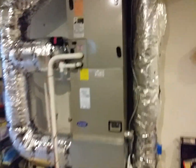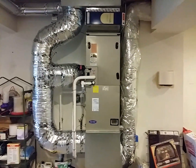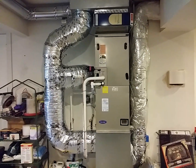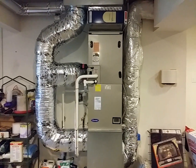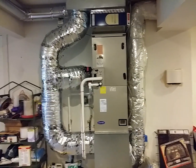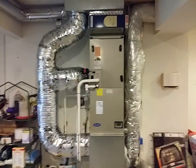It's super quiet out in the garage. This used to be a propane system — there was a high-efficiency propane furnace in here that had no ability to stage down. It still had four zones, so we took the four-zone Honeywell system, adapted it into the Carrier four-zone system, put on the five-stage, and it's like a match made in heaven.